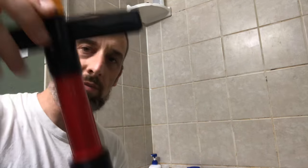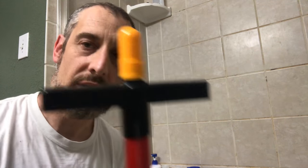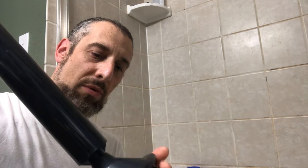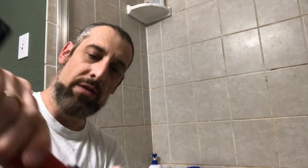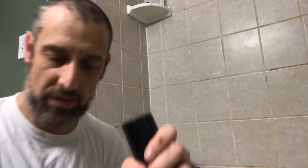These handles are here so that you can push down, and when you push down on this it pierces that CO2 cartridge and forces the air through here down into your drain and forces that clog out. Then underneath the handle there's a place to put a little membrane, and you put that in here — it's supposed to help control the blast so it's not too strong for your pipes, especially if you have lightweight PVC pipes.